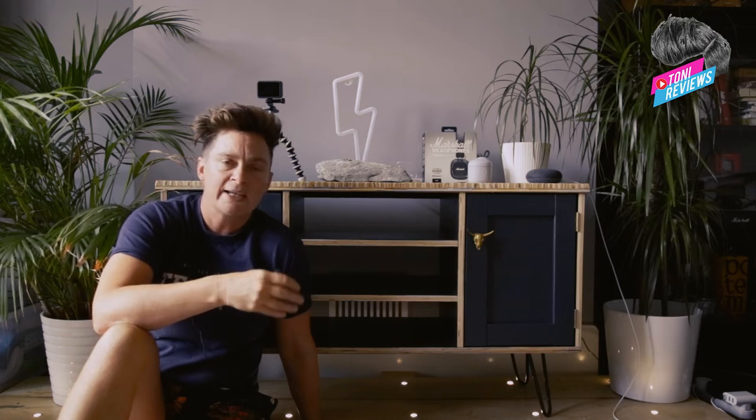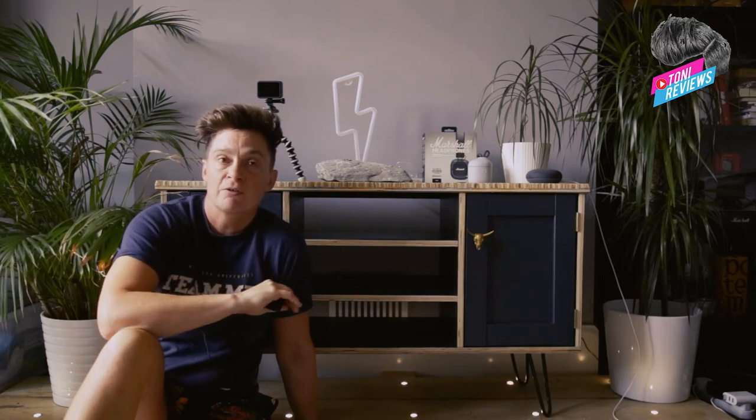One thing I noticed, which was only in editing the video, if you notice those big gaps that I had in the pattern, I was thinking, where are these big gaps coming from? I should maybe have some little ones, but why such big gaps? What I noticed when I was editing is that on the table, when I'm just about to glue up my first pieces, there's two pieces that are not the same size. I know there was a couple of strips that were bigger than the others, and I put them to the side, or so I thought. I obviously didn't. I cut them up with the rest, and they are what threw the whole pattern out.